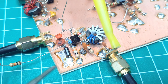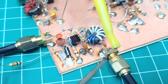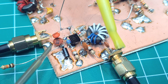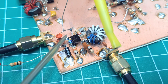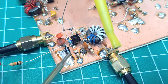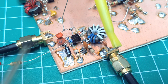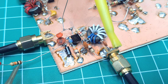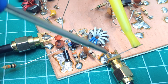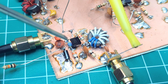Here you can see the prototype using my favorite technique, the spider technique, as I call it. We have the input signal here on this connector, where we connected the tracking generator. And this is the output connector where we are measuring the output power, plotting the gain on the spectrum analyzer. Construction is very simple, using a single BJT transistor, a BC547. And what is important for this design is that we are using a diode as a variable resistor to control the gain. The small signal resistance of the diode is being used as the small signal emitter resistor of the transistor. We can control this small signal resistance by changing the voltage over this 10K resistor, generating an almost constant current on the diode. The other important thing of this design is the autotransformer on the output, that is converting the 50 ohm impedance of the output to a much higher impedance at the collector of the transistor, so we can get the maximum gain of this stage.